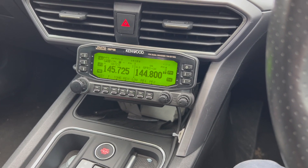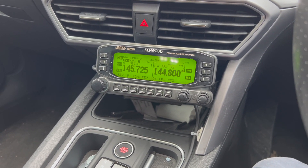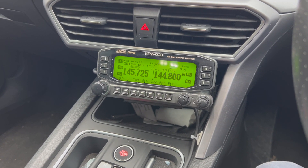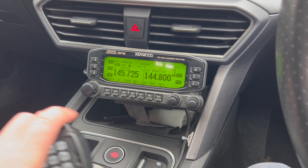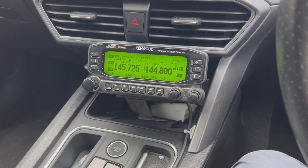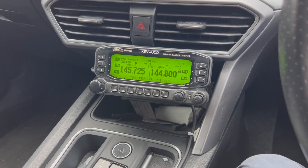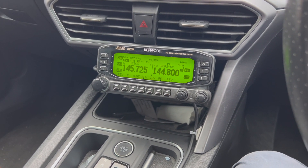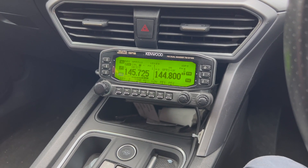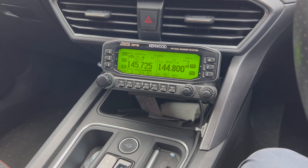Finally with the car put back together again, the aerial on the boot, the boot lip mount is tested and it's got good ground to the car. The antenna is connected back up to the radio. The SWR is pretty good - spot on really for what we need. Just a quick test on low power to get into our local repeater. Low power on this radio is 3 watts, and from my location on 3 watts it's a bit of a push to get into the Gloucester repeater with a radial null where I am. So if this actually works, we know our SWR is all good and ready to rock and roll. And we are cooking on gas - or in this new modern world, heat pump.